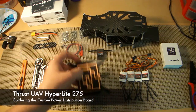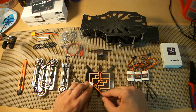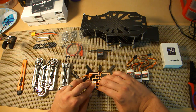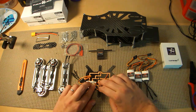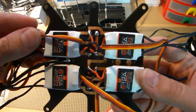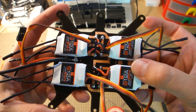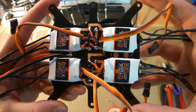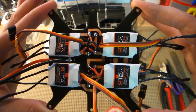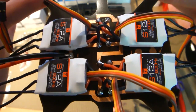I'm going to get started here doing some soldering. I'm ready for the power distribution part of the build. The ESCs are going to sit down like this, and you can see there's a positive and a negative point on the board for each. I cut the wires to about three quarters of an inch and wired the positives to positives, negatives to negatives. I used a little bit of hot glue under each one of these ESCs. I know a lot of people use wire ties, double-sided tape — I kind of like the hot glue. It doesn't leave a residue once you peel it off. For once, my soldering job actually looks pretty good.